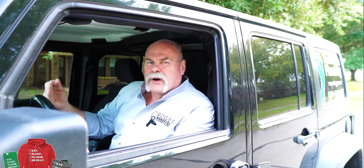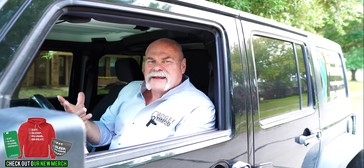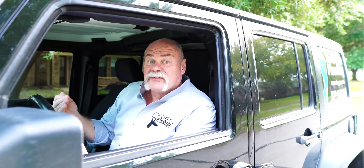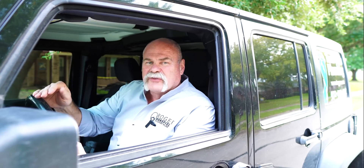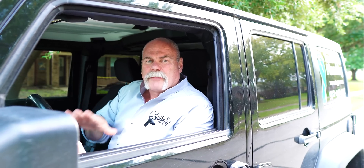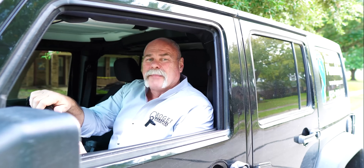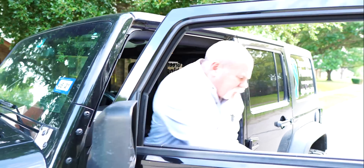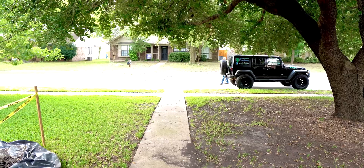This house was built in the mid-80s, and that's when we went from cast iron to PVC. Plumbers who had been installing cast iron knew you really didn't have to support it super well — it didn't have to be perfect. But PVC is a little different; you need that continuous bedding. If not, when you throw the earth on top and start packing it down, it'll put those fittings in a bind, and unfortunately I'm afraid that may be what happened here.